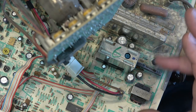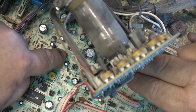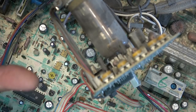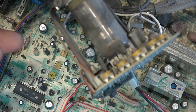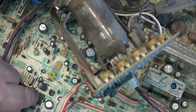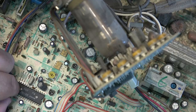These are also the ones that had the tuner problems and the IF can problems for the tuner. It uses opto isolation. If you look over here, you'll see there's two optical isolators on the board right here. These are to isolate the video, because it's got AV inputs and it's a hot chassis. So people have in the past said, why not put RGB into a TV? Well, it'd be easy, and yes, it is, because most of the jungle chips like this have an RGB input that is used for the on-screen graphics. And it's easy just to modulate those with video for red, green, and blue.